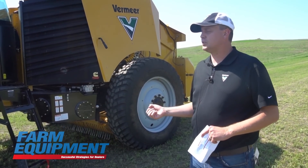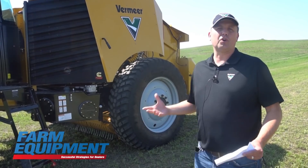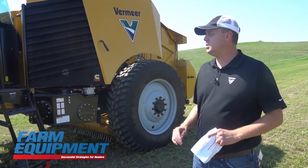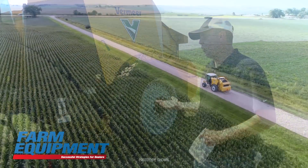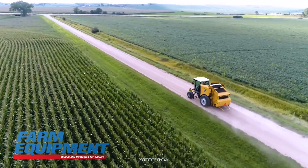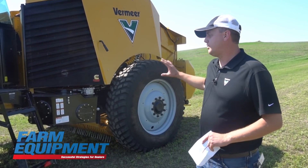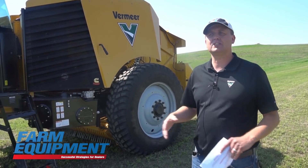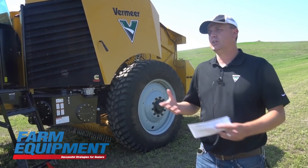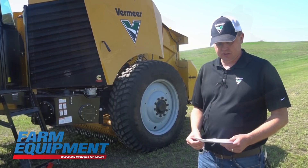What we find with a lot of other self-propelled machines is that going down the road at high speeds you can get a little squirrely in certain conditions. So when we go into transport mode, we can transport the machine at 30-plus miles per hour — we actually lock those casters and steer with those wheels in transport mode versus using zero-turn casters. You're able to go from field mode to transport mode and feel confident in how the machine will act in both conditions.